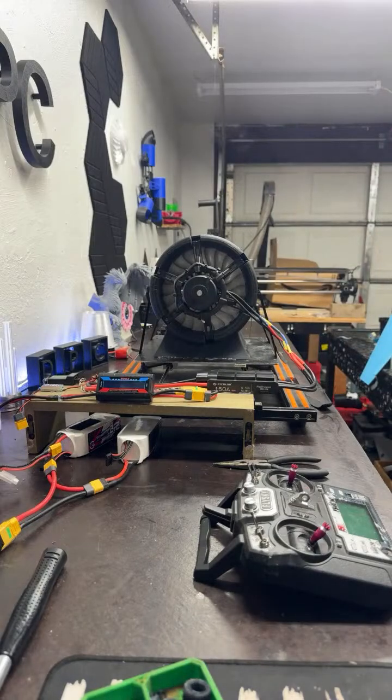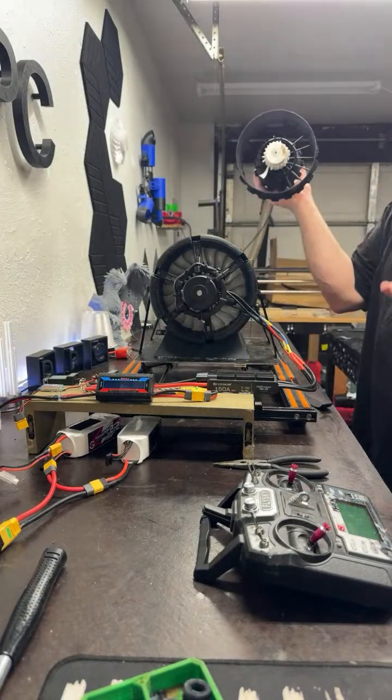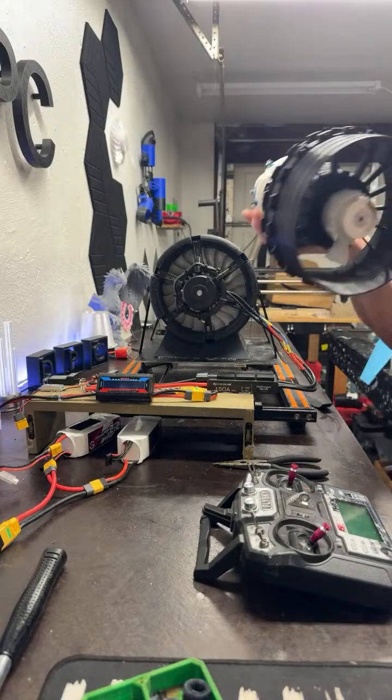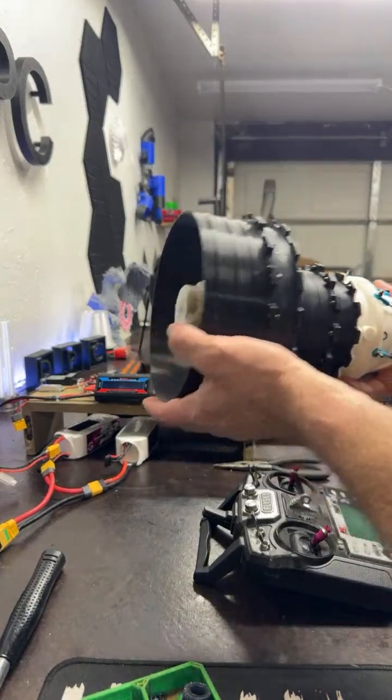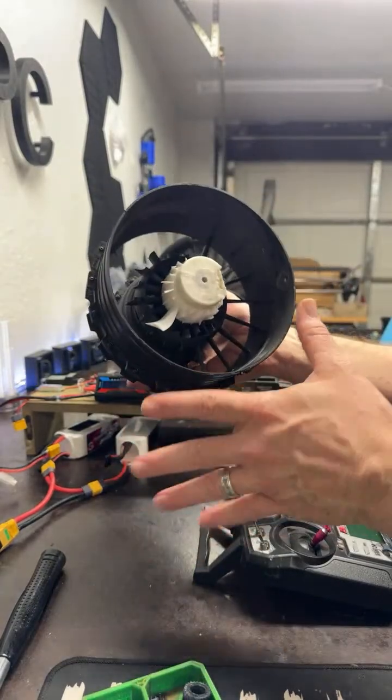With the nylon 6 gears, I got past what I got past just now, and it started to scream. It actually got to the point where I was like, okay, I'm going to get behind. I've got a very heavy iron table, and I was down below this thing because I don't want to get hit by anything coming out of there. But from prior experience with Stubby Fan version 1, this one was my longest running one. It was my longest running fan, and it ran 6-8 months, maybe somewhere around there, before it finally gave in.